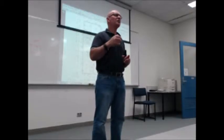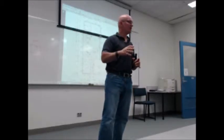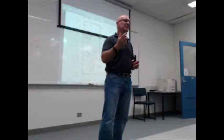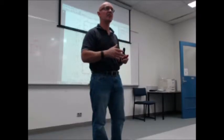In standards and tolerances. And I just thought it very strange because it was right through the whole job on a slab. It wasn't a bad tile job or anything like that. I just happened to see it at the client because she brought it to my attention and I've gone, yeah, well, they are lipped. And I've gone through and marked all the lipped ones. I said, I'd like to see the tiles.